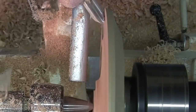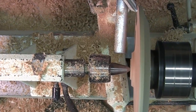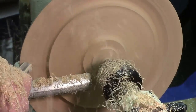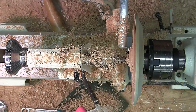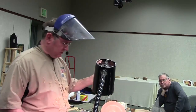And I'm trying now to look straight on both faces at the same time to figure where the curvature is going to happen to follow inside. You want to get a uniform thickness, because it just feels better. And I'm going to have a little bit of a rim at the bottom of the plate. It's not going to have an absolute flat bottom, as you can notice on this plate here. It's got a rim. The rest has been taken away. Most of the plates in your kitchen sit on a rim. The whole bottom isn't flat because it could wobble, especially with wood. It'll pick up moisture and change its dimensions.